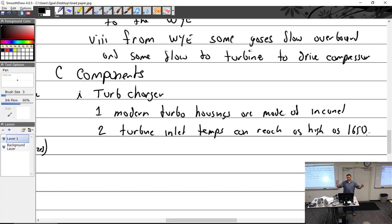So we've talked a lot about exhaust gas temperature probes in piston engine aircraft, and I've always said there's no red line at all for exhaust gas temps. It is what it is. You can only make it go so high. The one thing that is not that way is turbine inlet temps. They are redlined. You have a maximum, and you have to be really careful of that maximum. So when you're leaning out and watching your EGT rise to peak EGT, you've got to be careful not to exceed that 1650 or you start melting turbo pieces. When turbos get really hot and exceed their temperature, because they're spinning so fast, they stretch. And when they stretch, they start rubbing on the housing. And then when that happens, you've got to get a new turbo.